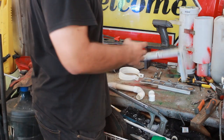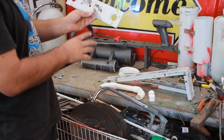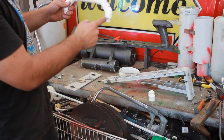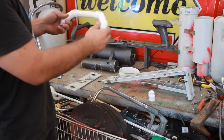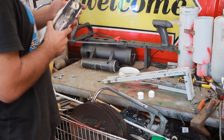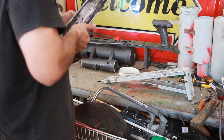I just finished cutting up all the metal and drilling it and everything, and this is basically what I'm finished with. This is the front plate - I cut the holes out for this handle. I'll move on to the handle - the handle is two 45-degree elbows. This is a 25-mil pipe. The reason I use 45-degree is because it gives it a gradual turn. You can use a normal elbow, but I like this look. It's just bits of pipe - you just glue that all together. And the way it mounts on this is you put it through the two holes. You put a bit of glue and then you put these caps on. And what you're finished with is this nice clean-looking handle system.